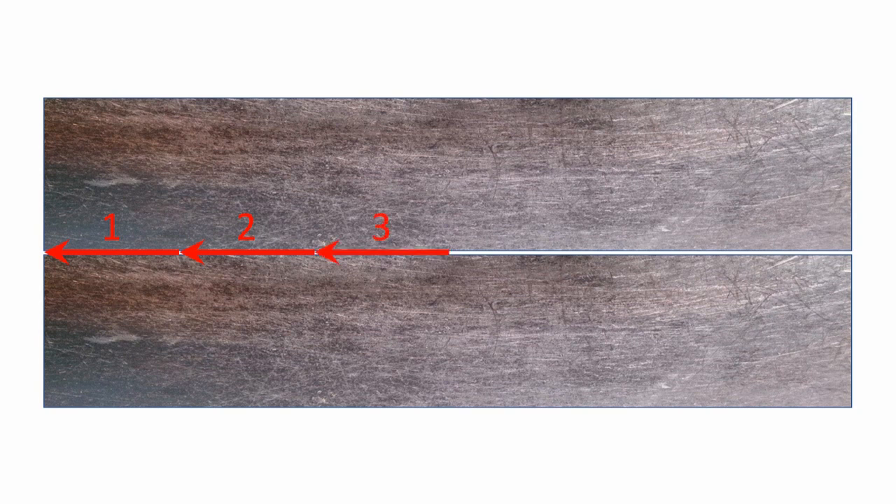The trick is to keep the sections the same length, run the same travel speeds, and use the same basic techniques. In the video that follows we're going to look at the end result of two plates that were welded with 052 flux core wire at 25 volts. The plates were one-eighth inch mild steel.